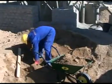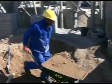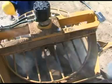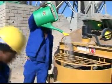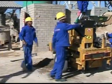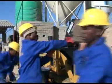The alternative to hand mixing is using a Hydroform pan mixer. Always level off the wheelbarrow to ensure correct quantities of soil are mixed with the cement. The soil is placed into the pan mixer along with the cement. The mix is dry mixed for approximately one minute until the mix is an even colour. After dry mixing, the water is added — never pour the water in directly, always use a sprinkler to evenly blend the water and mix. After one minute of wet mixing, the entire mix is released onto the ground and shoveled into buckets. The bucket is lifted and emptied into the soil hopper. The soil hopper is moved over the chamber to fill it.